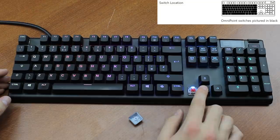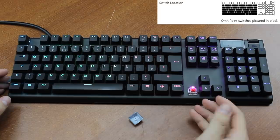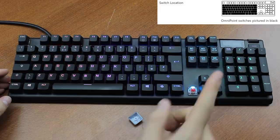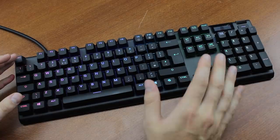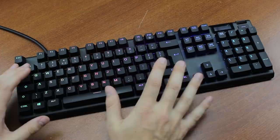And I get it, it's probably not even very necessary to make it all Hall effect, and I guess leaving them off allows them to price it more competitively, and frankly these Gateron switches really aren't half bad either, but it's definitely a thing. Nowadays, Hall effect switches aren't anywhere near as expensive as they used to be in the 70s, as prices of semiconductors required to make the Hall elements that the sensors are based on have decreased considerably. But the main cost issue, or so I've been told, is in calibration and the sheer computing power necessary to monitor the analog outputs of all these switches at the same time.